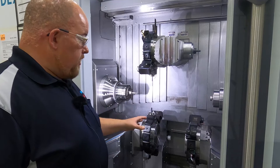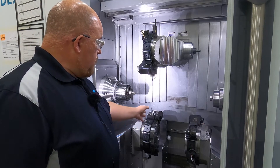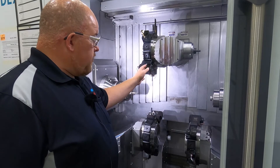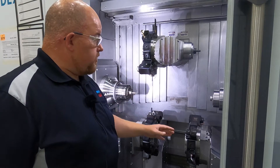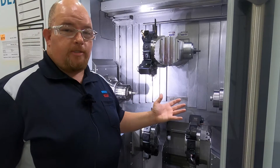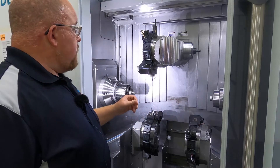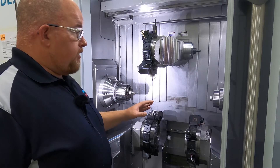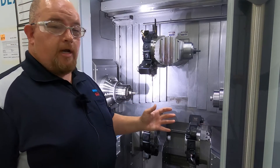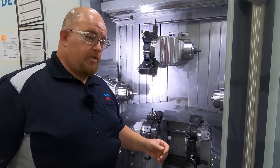In this particular setup we have some radial live tools, some axial live tools, some static tools — any combination you can see on a typical setup depending on your part and your geometry. We're going to go through and start up the trace program and I'll explain the operations as they're going on and touch on some more key features of the machine.